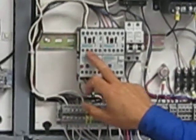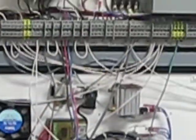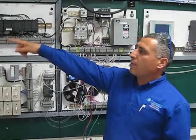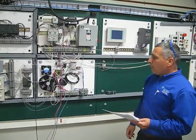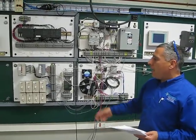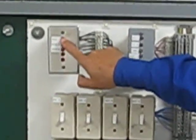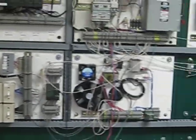The three-phase starter controls a three-phase motor down here, and the single-phase one is simulating what could happen to a three-phase motor. We have a single-phase contactor attached to a single-phase fan right here, which simulates the second pump in our application. We could have used another three-phase contactor but decided not to tonight. So we're going to be turning these pumps on and off manually, and we have an indicating light number one that will go on when the system is in auto.